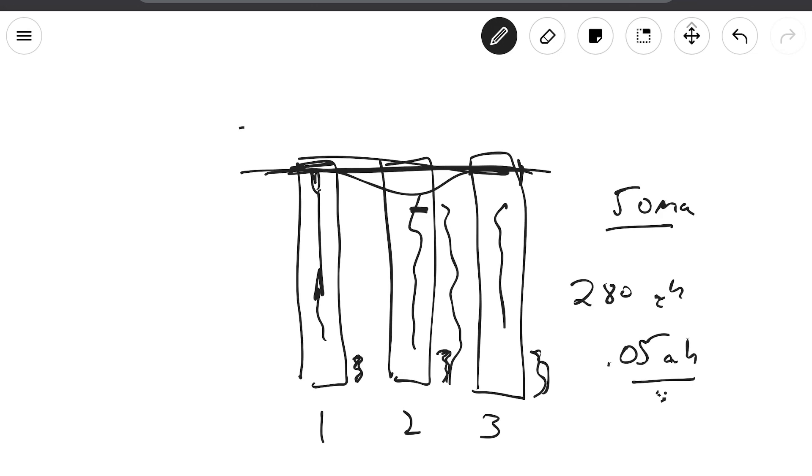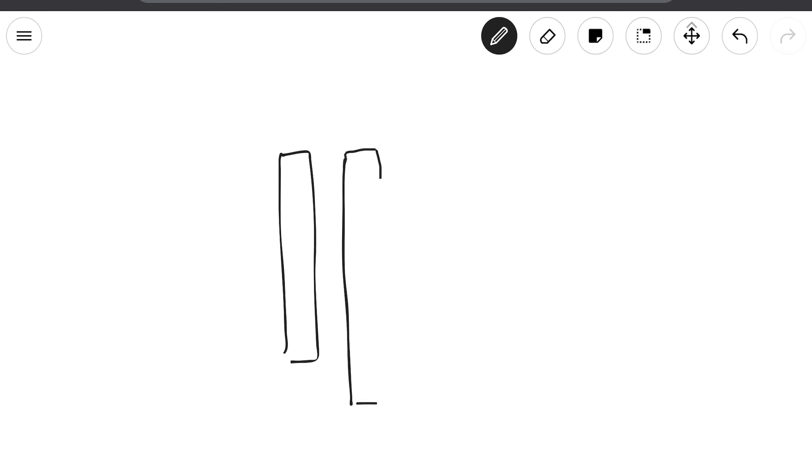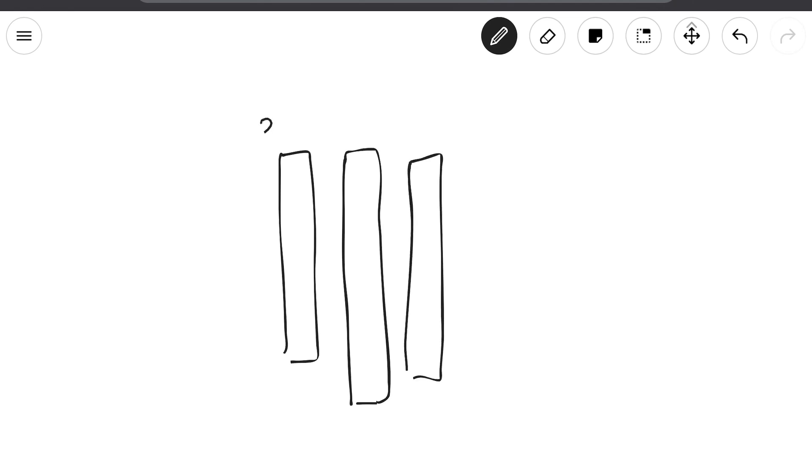In addition to costing money, you're going to check your cells anyway, so you might as well just do a good top balance. Most BMSs do have a passive balancer built in, but it's really small — usually in the order of 50 milliamps. This is a really small amount of power. If you have a 280 amp hour cell, that's basically 0.05 amps. So if there is an imbalance of a few amp hours, it's still going to take a very long time for the passive balancer to fix it. But if you have a BMS that has passive balancing, it will help flatten things out, though it is no excuse for not checking your cells. If you've got great cells, it's just not necessary.